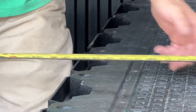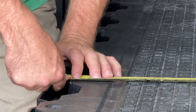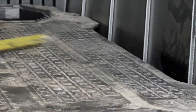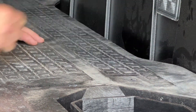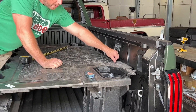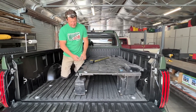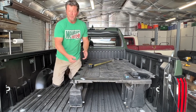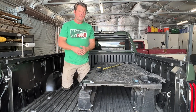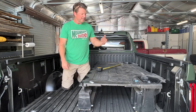Half of 63 and 9/16 comes out to — let's just say 31 and 3/4 for round numbers. So if I put 31 and 3/4 here on the tape measure, I can see that the midpoint falls right at that mark. Where the deck system gets proud with the traction area, if I cut down along the lower seam on both pieces, this should fit perfect. There might be a little give or take with a gap of around 3/16, but I'm going to try this with a regular skill saw.